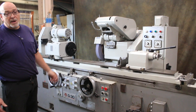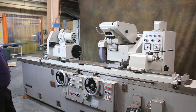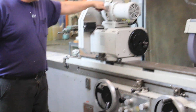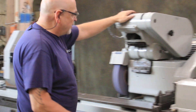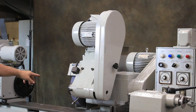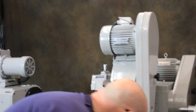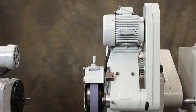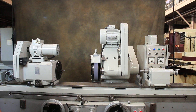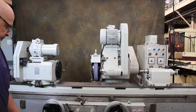This is an exceptionally nice machine — it's Japanese, built like a tank. You've got a dial indicator here for your correction of taper, and variable speed on your headstock. It's got a fold-down ID spindle: as soon as I come off the switch in the back, the grinding wheel stops immediately because it knows I want to use this. And there's your ID spindle. That's the Shigiya G30.